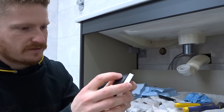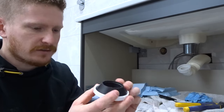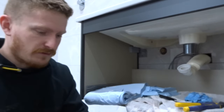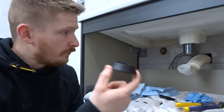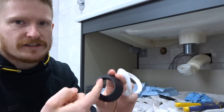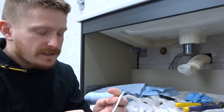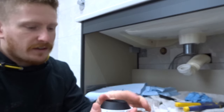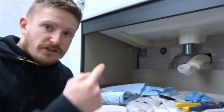What we'll do next is grab one of these. I call these Magic Seal Kits, but I think they're called Thomas Dudley Basin Waste Seals or something like that. I'll stick a link in the description where you can grab yourself one. Basically what this does is it creates a really good seal on the bottom of the sink unit, and the threaded area inside here creates a good seal as well around the threads on the basin waste. This collar obviously tightens it all up and keeps it in place — it really is a magic seal kit.